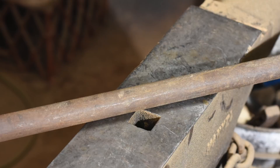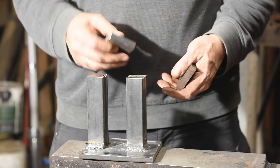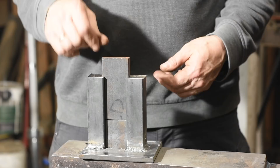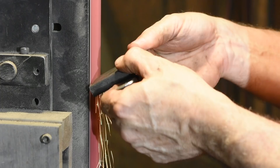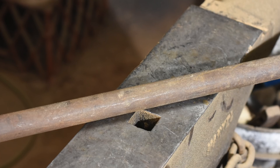I'll start with a piece of one-inch round stock and a bar of half-inch by two-inch stock, which is what fits into the little slide section of this guillotine. First I'll cut the pieces for the body of each die, then deburr them on the grinder. Next I'll cut the business end of the dies from the round stock. Depending on what radius you want to neck down to, you can substitute any size of stock.